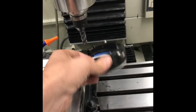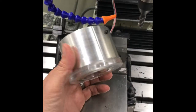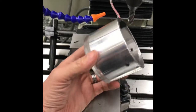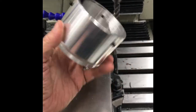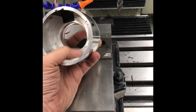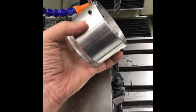It didn't look very good on my mill. Look at this — it's kind of sketchy, right? Plastic. What I did was I had a piece of billet aluminum kicking around the shop. I actually started this project before I bought my Enco lathe. I've got some video where I had an R8 collet and had chucked this up in my mill and initially turned this in my mill — I milled this out, which was very time-consuming, and milled a slot here for the power cord, tapped these guys for some quarter-twenty set screws.